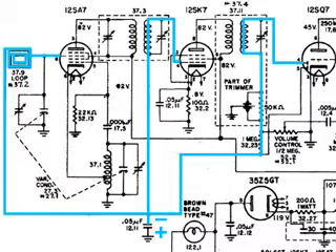Then we go over to the left, up through the antenna, and it goes up to the middle grid of the 12SA7. Now as the negative voltage increases, this decreases the ability of the first two tubes to amplify, thus limiting the volume. If we go off station, or if the station gets weaker, that .05 capacitor will start discharging, start going in the positive direction, and the tubes will start amplifying more, increasing the volume.